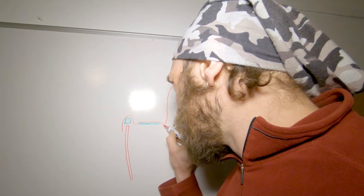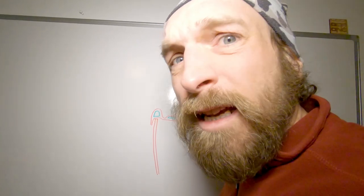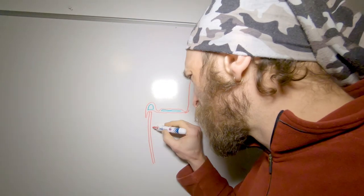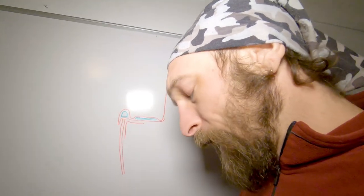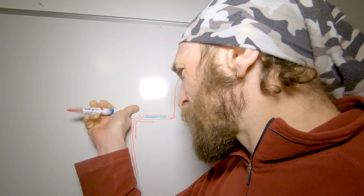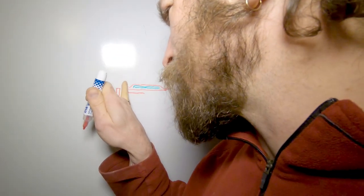Then what we look at from underneath the boat, underneath the deck, is that glass fibre surface. And then at the joint, there's another fiberglass tape which is applied like that. There you are. So that's how it actually is. Now the damage that we've got has actually completely smashed the deck rail off. I've now cut this edge off because it was just ruined and cracked and broken. So what we're looking at, we're going to have a look at this.